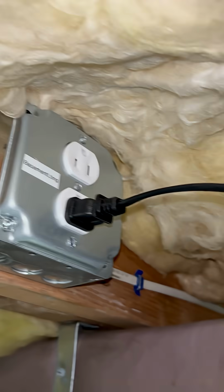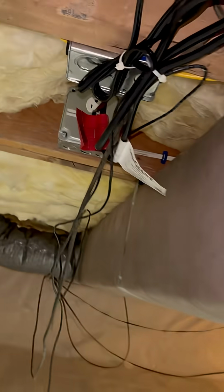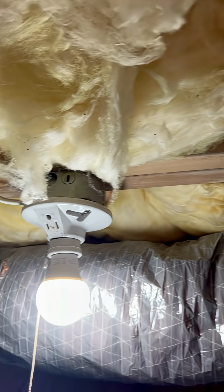There's also a sump pump alarm there, which the customer didn't even know was there. But then I added an additional plug off the lighting circuit, and the reason for that is in case that sump pump/dehumidifier circuit loses power for whatever reason, that sump alarm will have power off the lighting circuit, which has constant power, as you can see from that pull chain there.